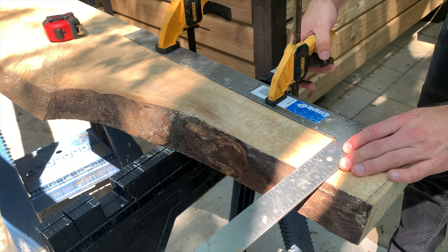At this point we have our form cut to the right dimensions — we have the base, the long sides, and the short sides. All we need to do is assemble everything together and screw it to the sides to create the form. To actually attach the sides to the base, I pre-drilled to prevent splitting and then used some leftover cabinet screws — honestly any screws you have lying around are probably fine, but pre-drilling is recommended to avoid splitting. After attaching all four sides, the melamine form is basically constructed.